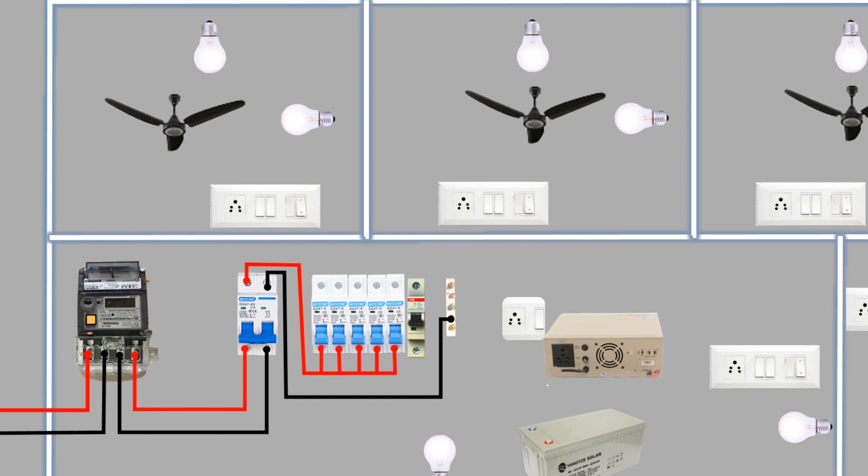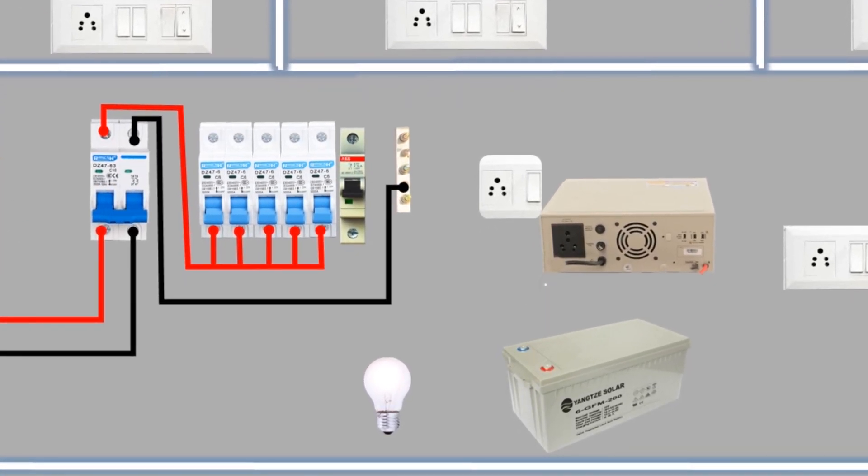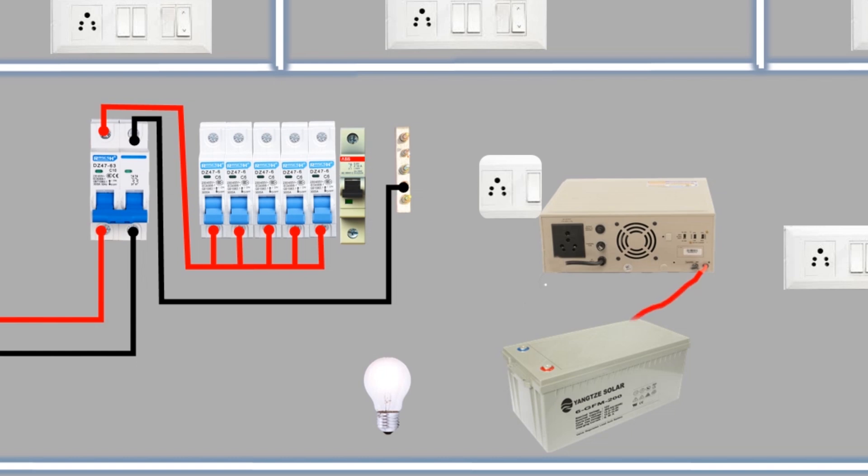For the inverter, we will connect it to two types of power supply: the battery and the main power supply. We have three wires — red, black, and a power cable connected to our inverter. The red wire is the positive terminal of the inverter, which connects to the positive terminal of the battery. The black wire is the negative terminal of the inverter, which connects to the negative terminal of the battery. The remaining power cable is used to provide supply to the inverter via a plug top. The brown wire connects to the right side of the plug top, while the blue or neutral wire connects to the left side. Through this wire, when the main supply is available, the inverter starts charging the battery.